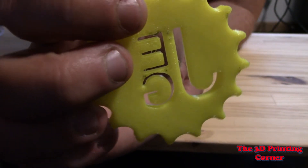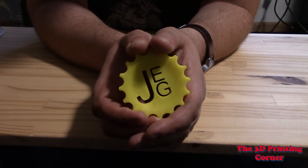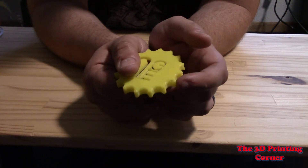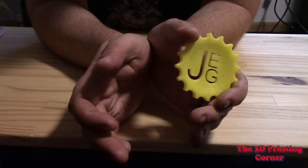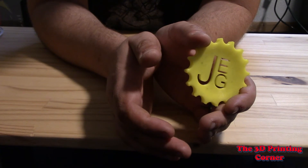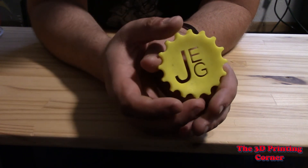Other than that, it actually turned out a really nice first layer. What I did discover after printing with this for a while is it likes anywhere from 185 to 190°C, and then to get it to stick and not pop the corners at all, I had to up it to about 65 degrees on the bed. 185 to 190 is really cool for PLA, and 65 on that bed is actually a little warm, but it's what works for it. So if you guys want to try this out, that's definitely where I would start — right about 190°C and then maybe 60 to 65 on your bed.